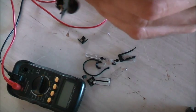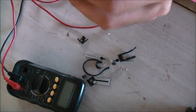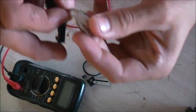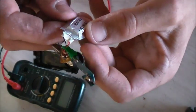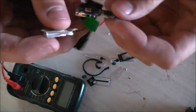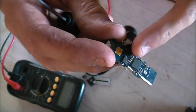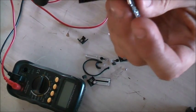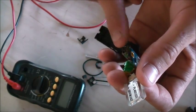Do a careful open up of that — very careful with the batteries, it could be quite dangerous. No circuit board in there — just the two tabs going into the battery. Maybe it's internal. Definitely no circuit board. Part of the battery protection must be... this little chip here must be part of it — part of the lithium battery management. Because it's got a lithium battery and there's got to be some sort of charging circuit. We couldn't rely on the USB device to do that.